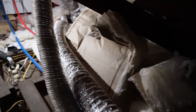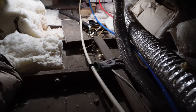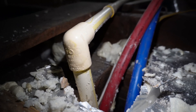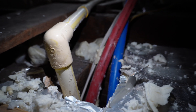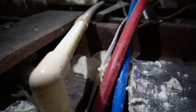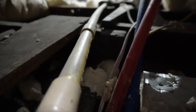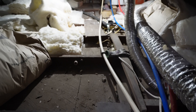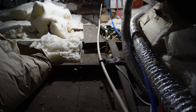The beam is going to span this entire length, and then over here I have a 2x4 — that's the new load point on this side that goes straight down to the block and beam underneath the house. I have to move this stuff out of the way obviously, but the point is to transfer the beam all the way over here, and then that'll go all the way back over there to that side.